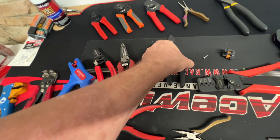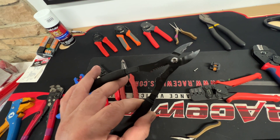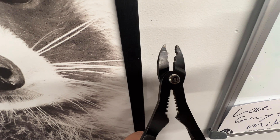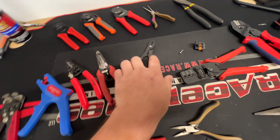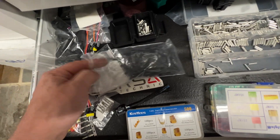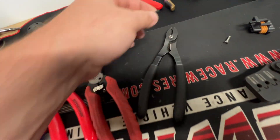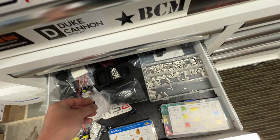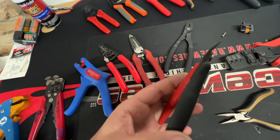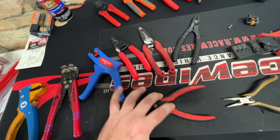This tool is extremely nice — I've shown it off many times, and I have two versions including a backup. This is for crimping uninsulated connectors. Once you get used to these, you can crimp the tiniest wire, use pre-cut heat shrink, crimp two wires together, and the result is almost the same diameter as the original wire. You should also have decent side cutters — they're incredible. Just don't cut big wire with them or you'll snap the jaws clean off.